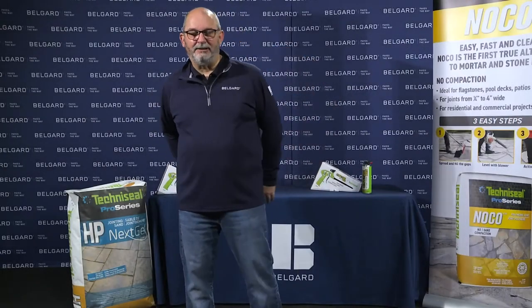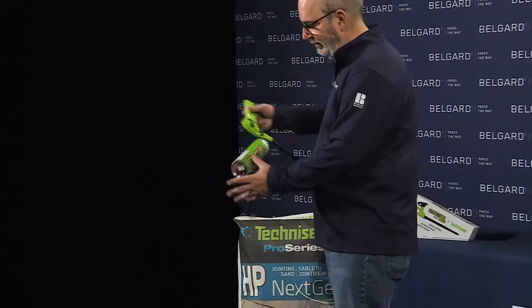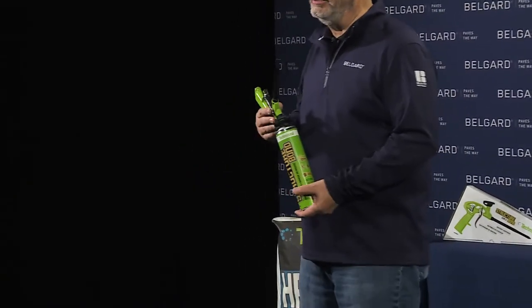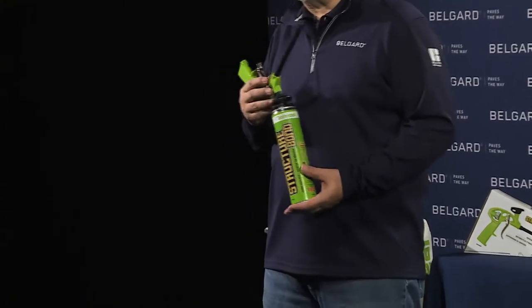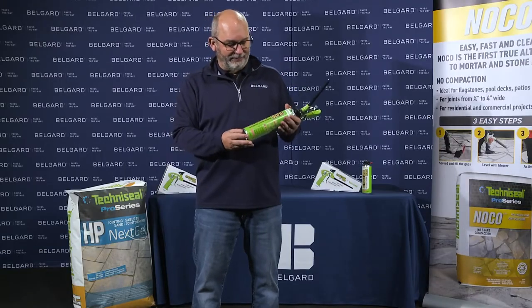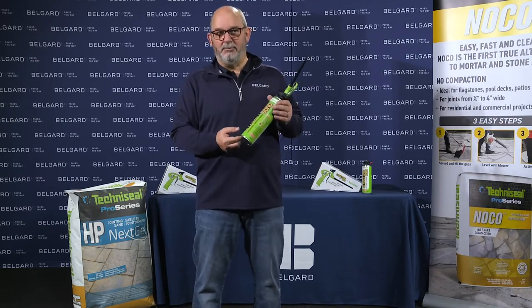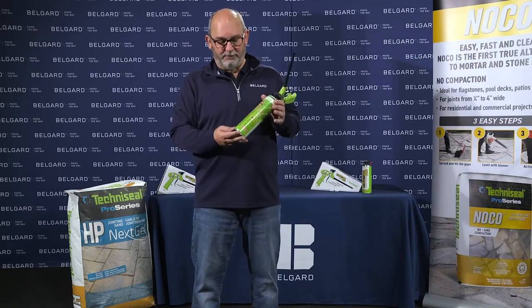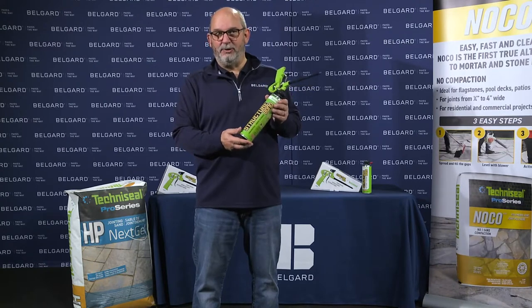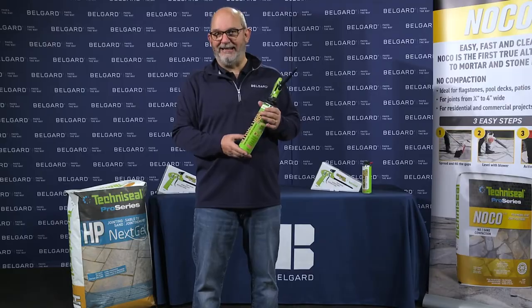The first product I'd like to bring to your attention today is Structure Bond from Techniseal. So this is a new adhesive product in the industry. It's an aerosol or a foam adhesive. The important thing to know about this is that it's the equivalent of 20 tubes of PL. So for one can to equate to 20 tubes, that gives you about 600 linear feet in a can.